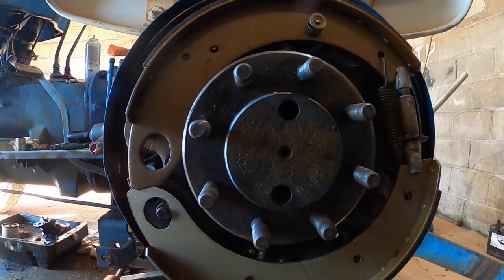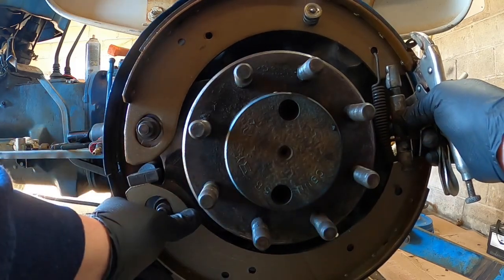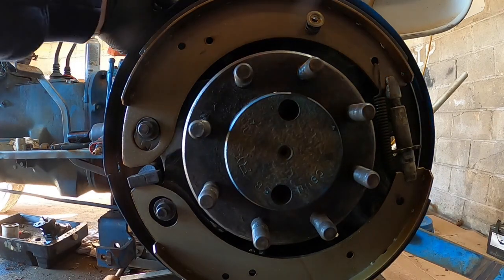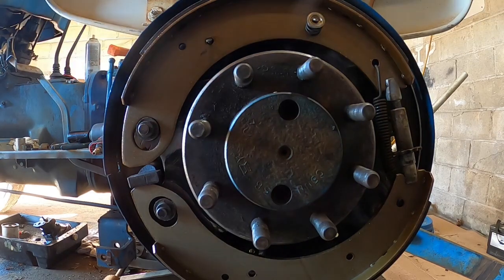Well, I had to turn the camera off for a minute — need 15 hands doing this and it's been years since I've messed with drum brakes and these springs. My phone's steady going off over here behind me, so I apologize for that. What you want to do is get the spring adjuster in, kind of holding this in the shoe, and then they're supposed to go up and over like so. The bottom one will kind of hang. But with these top ones you've got to kind of get the pins started in there. I need to get a little better lighting here in the shop when I'm working on stuff, but I just haven't made it that far yet.